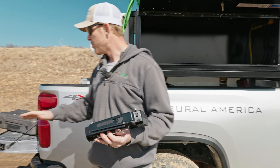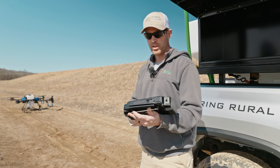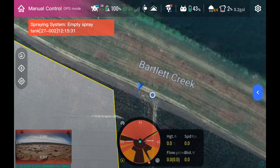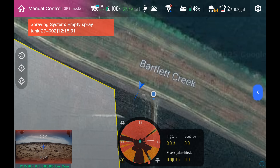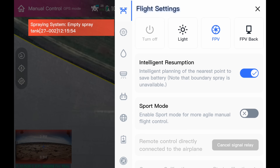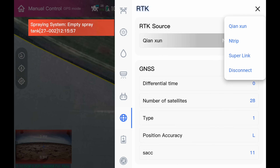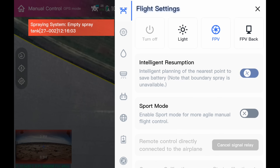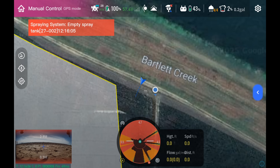We're far enough away now, and I have something to duck behind if I need to. We're going to check and make sure we have enough battery in our remote and drone. Up in the top left we've got 100% battery in the drone. We have 28 satellites and 43% battery in our remote — that's good. Our tank is empty, which is what you want for your first takeoff. One last thing: it says RTK, so we're going to make sure we are not on RTK and will disconnect it to just fly on regular GPS mode. We're disconnected — should be good to go.